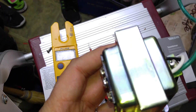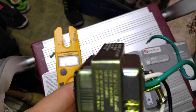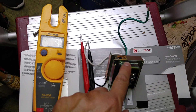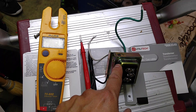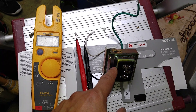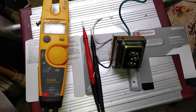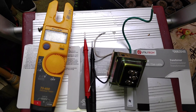What I did was start at where the doorbell is in the house — the front door — and since our house has a basement, I started looking directly beneath that. A popular place to look would be in the furnace room. You want to look for something like this in the furnace room. If you don't find it there, check by your electrical box. Sometimes a furnace room will have a transformer, but it's used for controlling the valves for your furnace to allow heat into different rooms, so just make sure it's not that one.